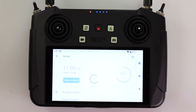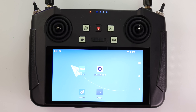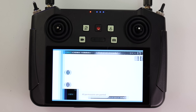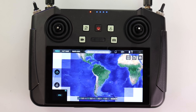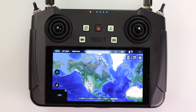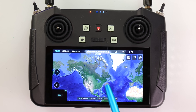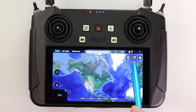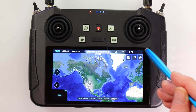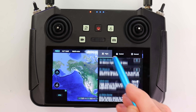This device comes with 16 gigs of internal storage, but most of it is already taken up by apps and the operating system. The app you want to use to control your Swan Voyager is called HEQ Fly. Looking at the app, across the top you want the notification screen to say "GPS ready to fly." You can see your satellite count — you need at least nine or ten to fly — plus map data. Up top is the battery voltage of your drone, then there's a menu to get into all your flight settings.